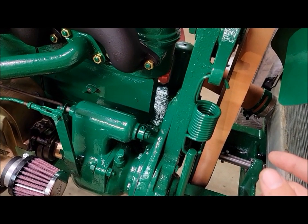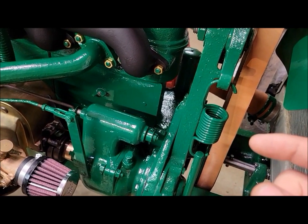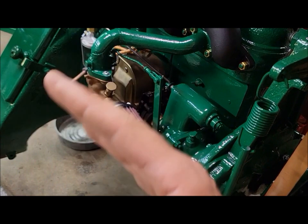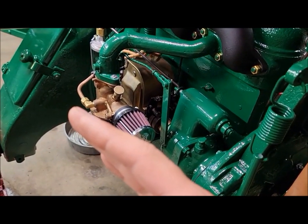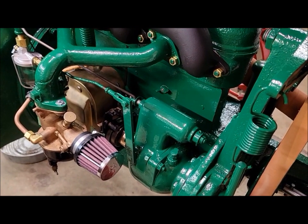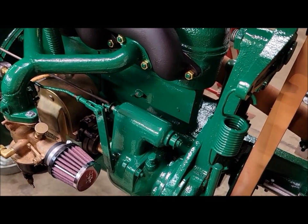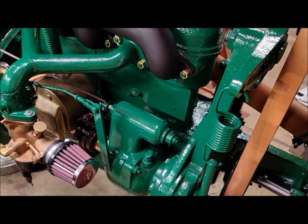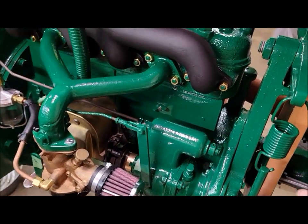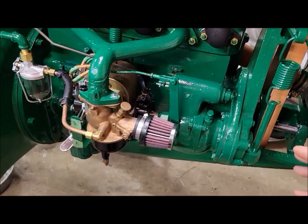and split it into degrees, 360 degrees, and we had to figure out where 26 degrees before top dead center is. Actually it's that way because it's before top dead center. So we did the math, made some marks on the pulley, put that to where it needed to be,